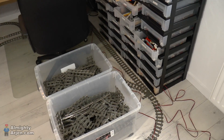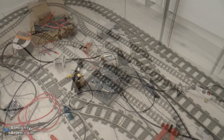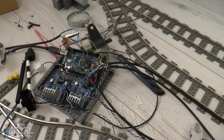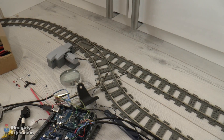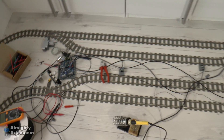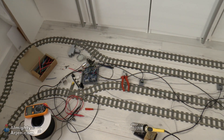Here's one station, there's one behind there, and the third one is over here. I'm now busy setting up the control system and putting everything into place. But like any other project I'm running into trouble — it has to do with this control system. This is an Arduino Mega with two motor control modules that control the switch motors and the tracks. The problem is that the wires to the sensors are becoming too long — this sensor here is connected all the way to the controller, about three meters of wire length.